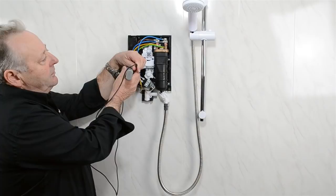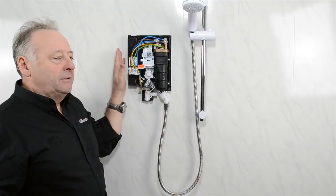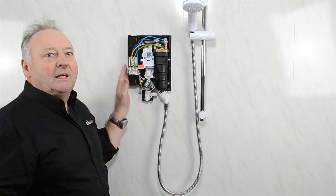This does seem a bit like belt and braces, but I remember going to a shower one time and finding that although I had the switch switched off and the fuse pulled, when I actually tested the shower there was still power coming to it. It was wired into the house next door — I'm sure it was a mistake.